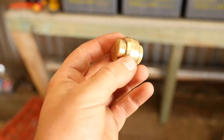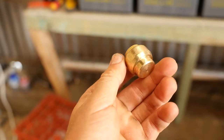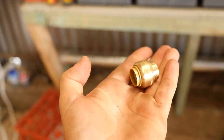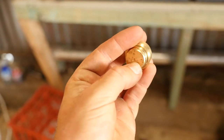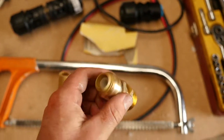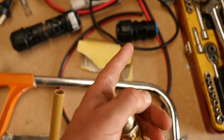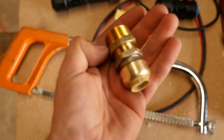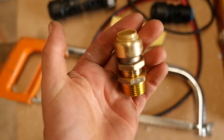With these connectors you can also get stop ends or caps. I'm going to put one of these where the basin's going to go, just so I can stop the water off for now because I'm not ready to plumb the rest of it — I just want to get the shower working first. To get the water in here, all I'm doing is connecting a poly pipe up to this shark bite connection. It's only going to be temporary until I get a proper setup, but it'll get me out of trouble for now.